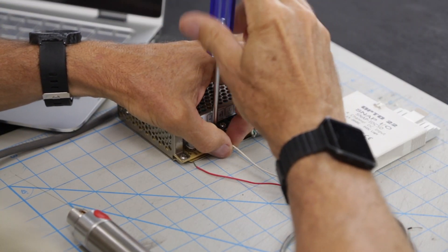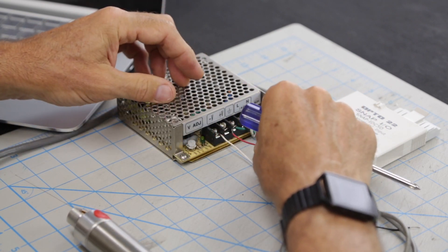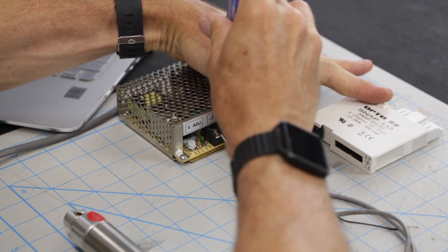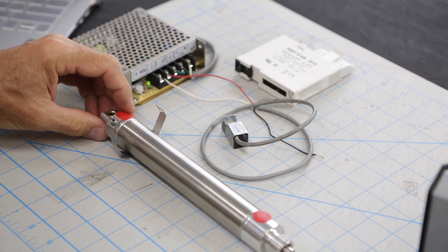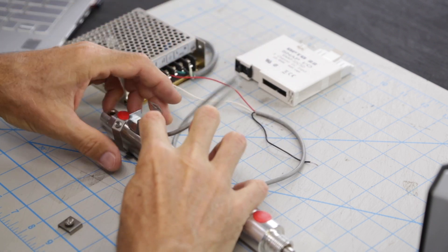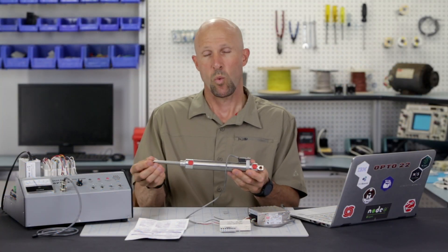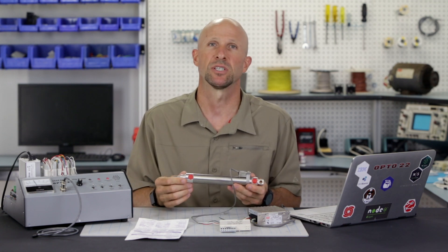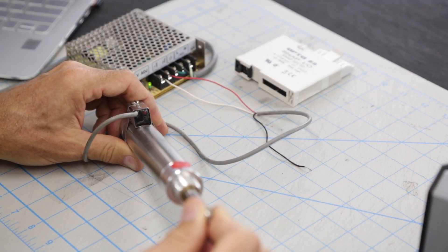First, let's connect the ground wire and then the positive wire. Now let's actually attach the proximity sensor to the air cylinder. We've attached the sensor at the top of the cylinder so that we know whenever the machine cycle is complete and the shaft is at the top. We can see the LED is working — every time the shaft hits the top of the cylinder, the LED comes on. So we know our sensor is wired correctly.